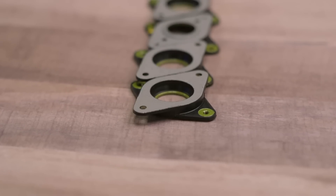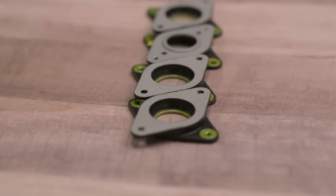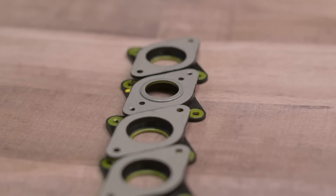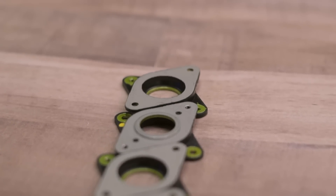Motor dampers were on the front of our list last year and they remain there this year. This is one of the easiest modifications you can make to your 3D printer that can have a significant reduction to the volume of it while 3D printing. This simple accessory is made of two metal plates with a rubber gasket sandwiched between them, installed between the 3D printer's motor and the frame. By decoupling the motor and the frame, you are less likely to encounter resonant frequencies that cause your 3D printer to reverberate during certain movements.